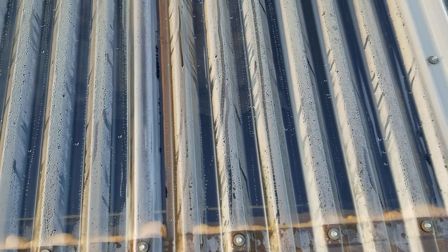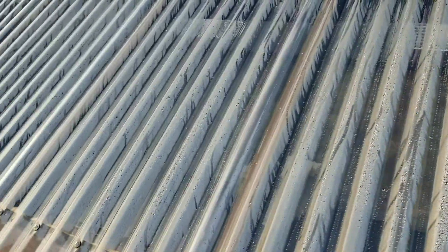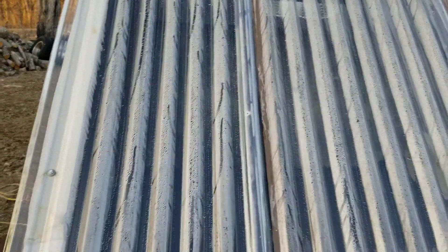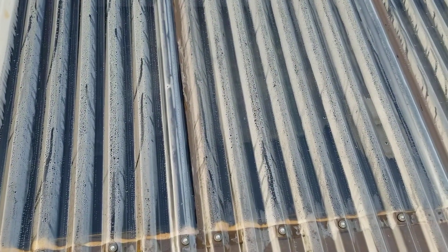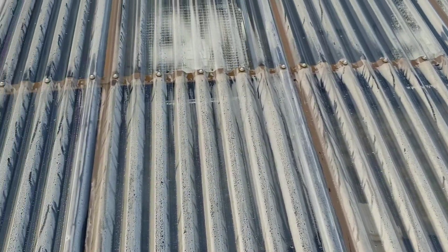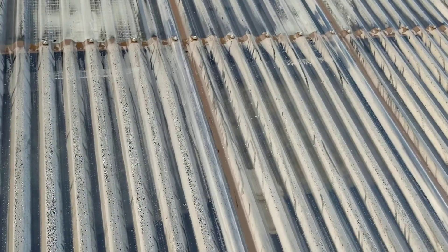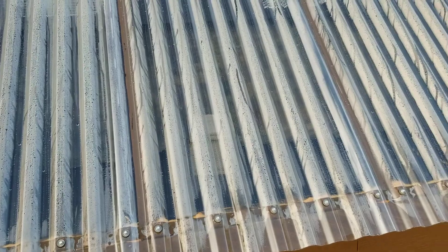Or else I'm not going to know what to do, unless I just leave all the vents open tonight and tomorrow. The heat's really rolling out of it up top. I might just take everything back to the house and see if I can get this dehumidifier working, pull some of that moisture out — but then my lumber's probably really going to crack bad and check, which is not what I want. I should have let this lumber air dry a little bit longer, but chomping at the bit, I guess.